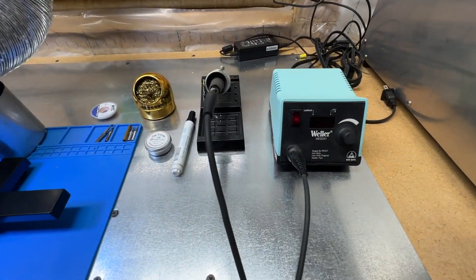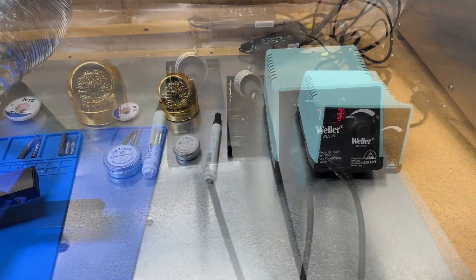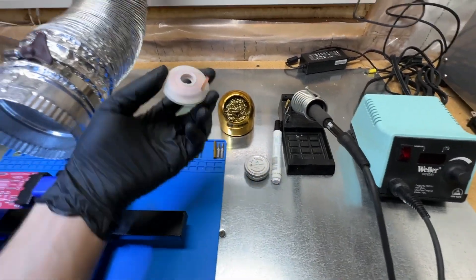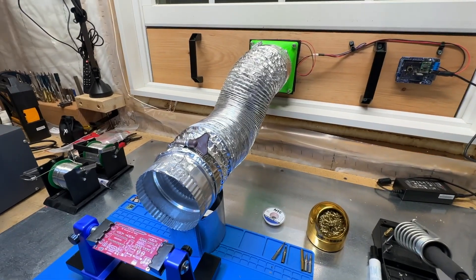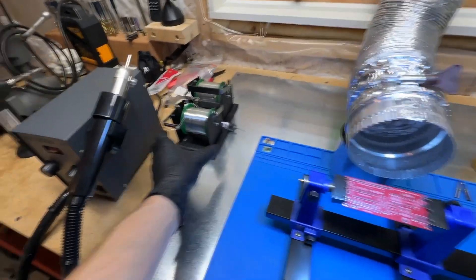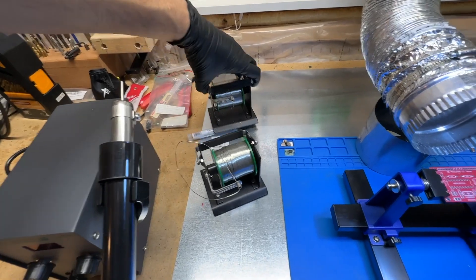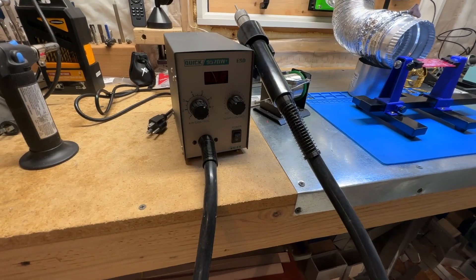I'll be using my Weller digital soldering station set to about 700 degrees Fahrenheit since I use lead-free solder. On standby I have a flux pen and some tip tinner. I have my wire sponge that I can't live without, and don't forget some no-clean solder wick — hopefully we won't be needing that though. I built a fume vent that clamps in the window at the back of my bench. It's made with a high CFM PC fan and a 3D printed hose adapter that I designed in OpenSCAD. I'll link to that 3D model in the description below. I have two spools of different diameter Kester lead-free solder, and I'll be using the larger one that has a diameter of 0.031 inches.